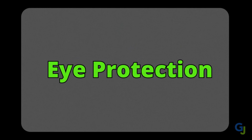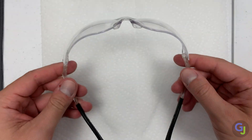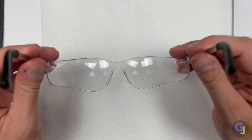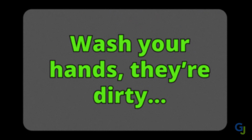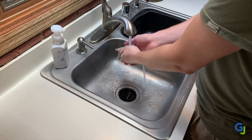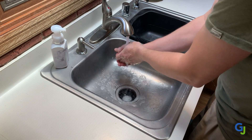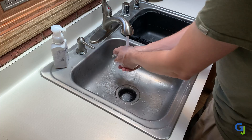Eye protection. You should also have something protecting your eyes while you're at it too. Wearing safety glasses is probably the best way to do this. I can attest that these should be worn since I've literally had solder pop and explode while I was working with it. When you're done soldering for the day, wash your hands. Flux residue and other debris get on your hands while you're working, and it's a simple task to eventually make into a habit.